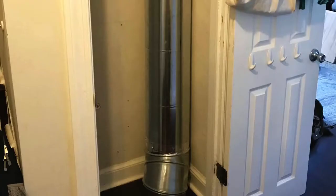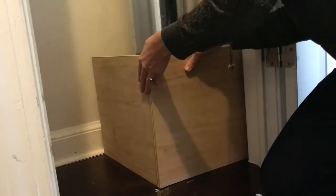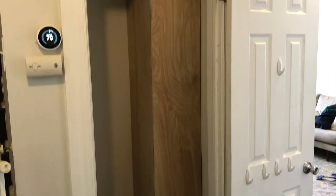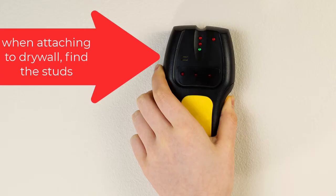The first thing you'll need for a cleat wall is a flat space. This can be just a regular wall, or you can build a panel like I did out of plywood. Because I'm attaching to plywood, I can nail anywhere along the cleat. If you attach cleats directly to the wall, you'll have to locate the studs and nail directly to the studs.